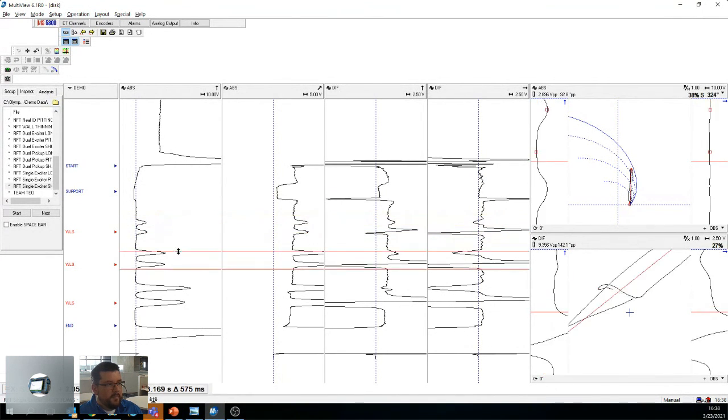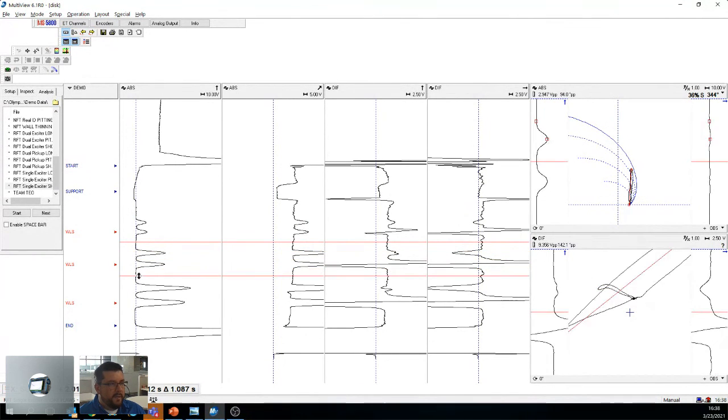and what that does is it can actually tell you if it's on 360 degrees, 270, 180, or 90 degrees of the material. In this case, I know for a fact it's on 360 degrees, and we know this because it's touching the back line. So this would be 360, this would be 270, this would be 180, this would be 90 degrees, right? If I have something that's only 90 degrees, my signal would stop around here. If it's 180, the signal would stop around here. If it's 270, it stops around here, and then 360. So right now, it's kind of in between both.